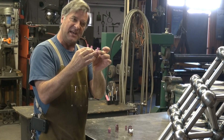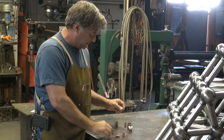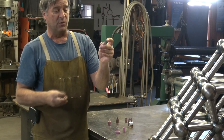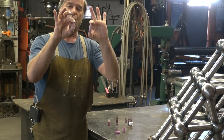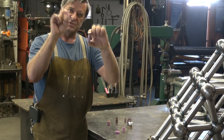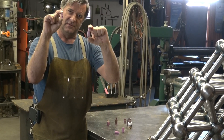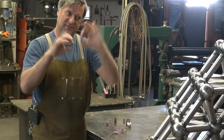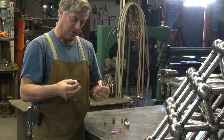This is a seven — you've got eights, nines. You even have different sizes depending on your torch. This is a four for a water-cooled torch, and this is a four for an air-cooled torch. This is a lower amperage, this is a higher amperage. It all depends on what piece of equipment you're working with, what kind of machine and torch you have.